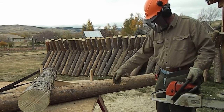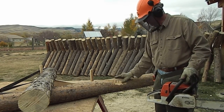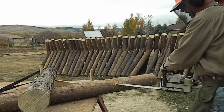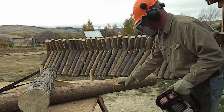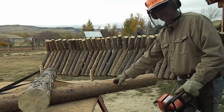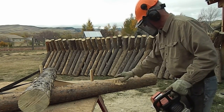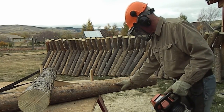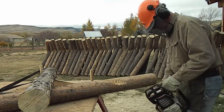I've cleared out some of the chips, and now what I like to do is make a nice cut called a plunge cut — you lay the saw in here like this. You have to make sure that you've got some wood behind the tip because it's a dangerous cut to make with a chainsaw, as it wants to flip the saw. So when I put the saw in here I try to hold it securely and then we clear these chips out.